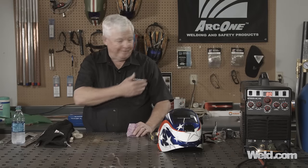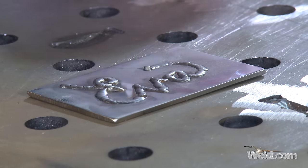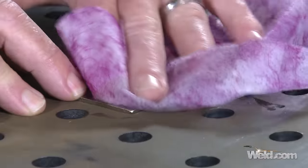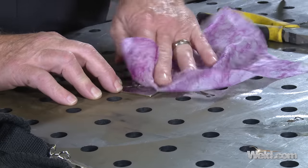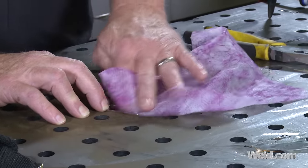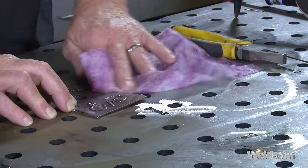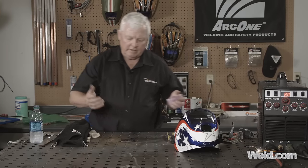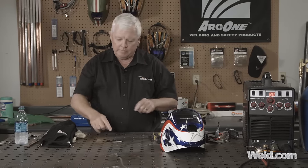Okay, because I used the polishing wheel and the buffing wheel there's a little bit of compound on those, so there's probably some residual on the surface. When welding stainless steel I'm getting a little oxide on there — a little chromium oxide — so I like to get it removed before I do the second layer. Because there's residue on there, I'm going to go ahead and alcohol-wipe this just to make sure there's no compound in the cracks or crevices. Then I'm going to get my gear on and do another complete pass over this name.